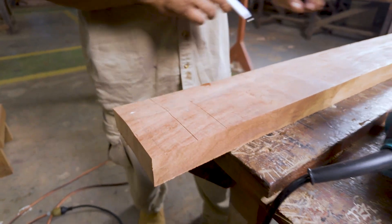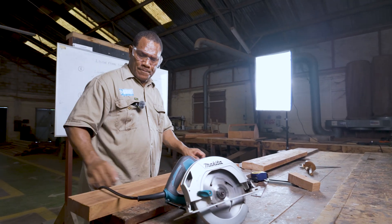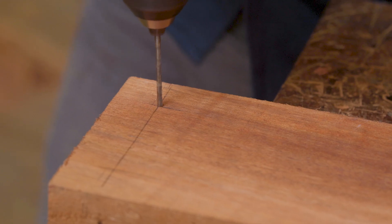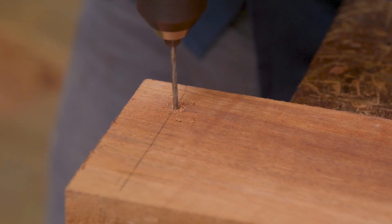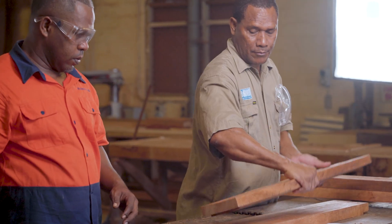Before doing installation, one very important thing to consider: you must not forget to bore small pilot holes so that you avoid cracking the timber when hammering in the nails for the side frame.